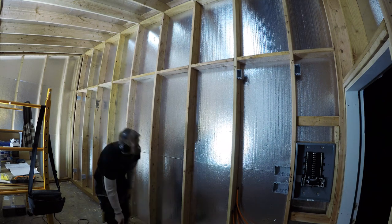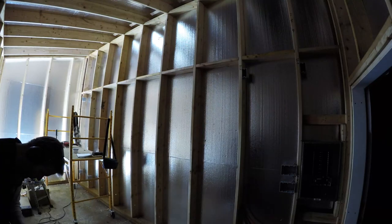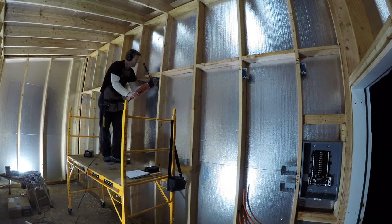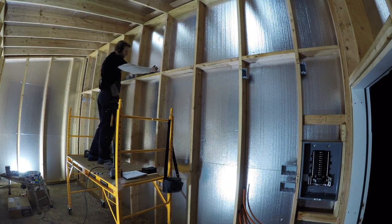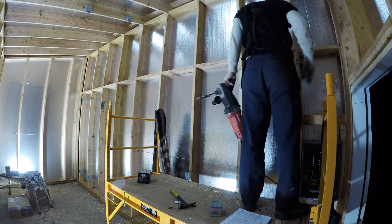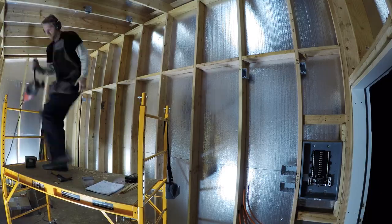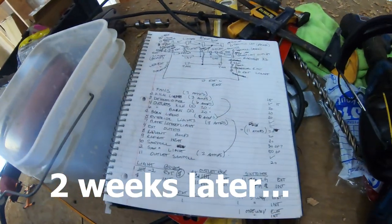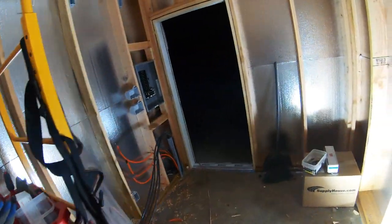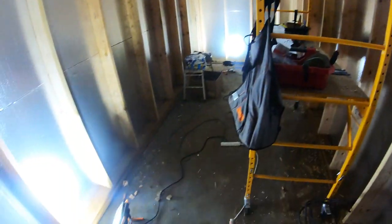After nailing on the boxes where I need them, I went ahead and drilled some holes and then it's time to run some wires and connect all the boxes together. The sawmill will need about a 50 amp breaker. The dehumidifier actually only needs a 20 amp breaker and of that it only uses about 6 amps or so. I also needed a couple circuits for running some heat lamps, a couple outlets just for plugging stuff in, two big fans that will go up in the ceiling, and a bunch of exterior lights. I got totally inadequate chicken scratch notes but I think I'll make it work.